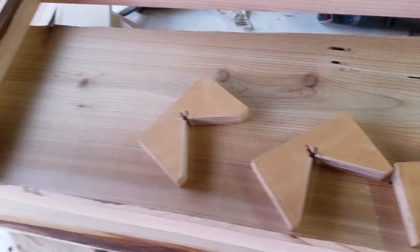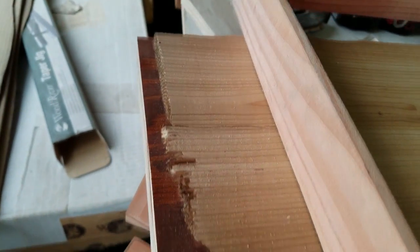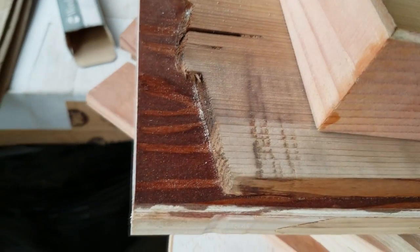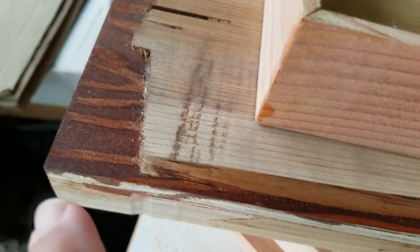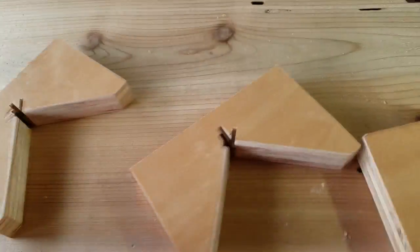What I'm going to do is inlay pictures all over here of old 40s and 50s RVs. And then we left the rough chainsaw cut here when we cut the tree down. So I'm going to have to go in here and brush all these end grains with epoxy. We're going to do a sealer coat. Get down in here with the brush and seal that up.